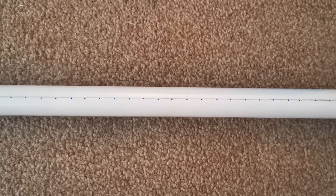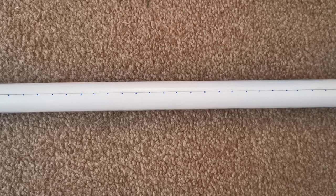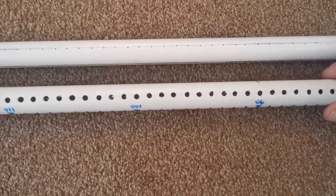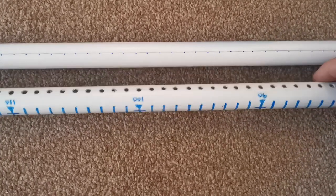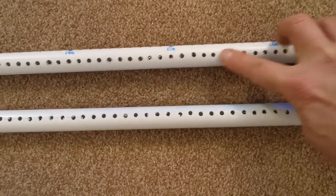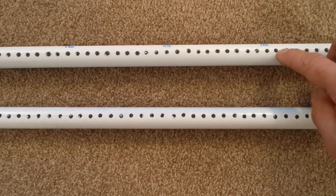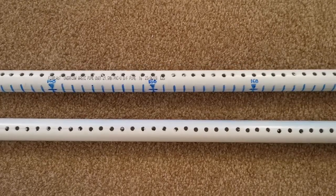On the 90 and 270 degree axes, you then need to drill them out - it's best to drill them separately, doing one side then the other, because you won't get through the pipe straight to get the holes in line. I'm going to start drilling this one out. There's your finished product - they're not perfectly in line, it's very difficult, but they're a lot larger than the pin we're going to put through there, so there's enough leeway. These poles can now be put to one side.